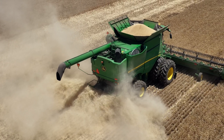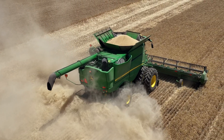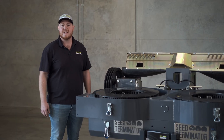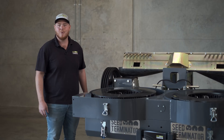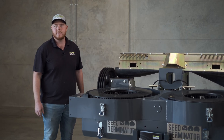Mills are also quite an expensive way to kill your weeds in terms of capacity and fuel. We're putting on a machine that's spinning at 3,000 RPM that's designed to kill 99% of ryegrass seeds. Unfortunately you can't kill weeds for free, and it's really important to make sure that you set your harvester up to get a desired outcome that will really help your farming system for the future.